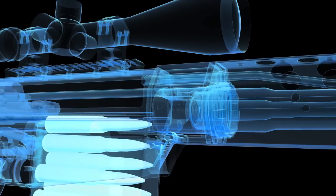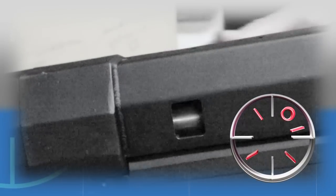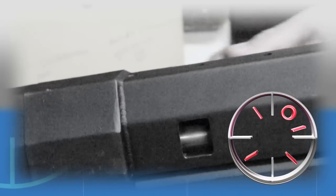What's unique about it is that the lug surfaces are cut on a helix, meaning that when the bolt locks into the barrel extension it's actually screwing itself in. Not only do we get away with using a tighter chamber than would otherwise be used in a semi-automatic gun, but you've got a system which is much more tolerant of dirt and out-of-spec ammunition.